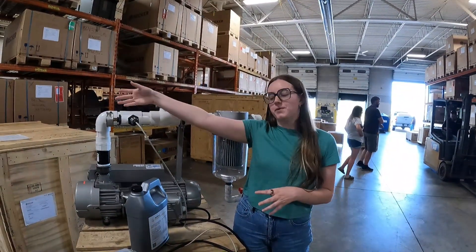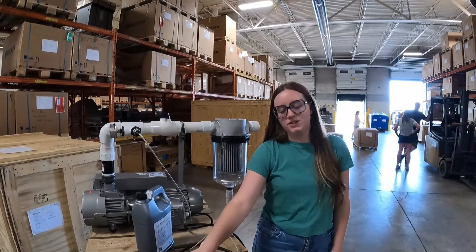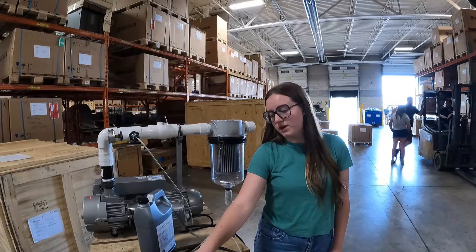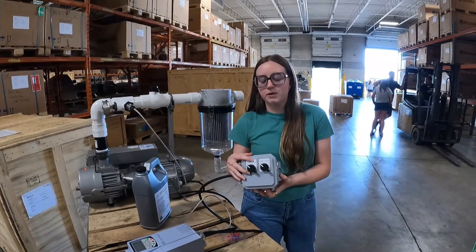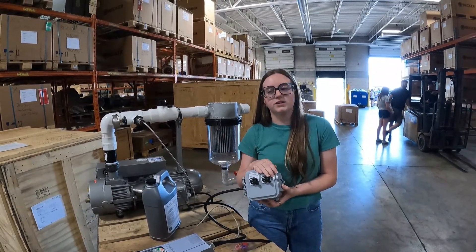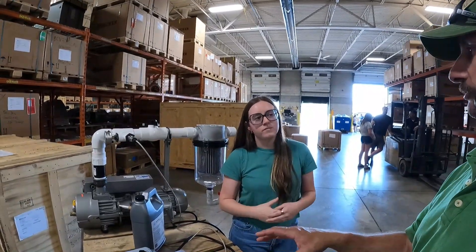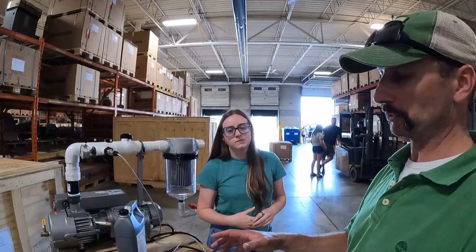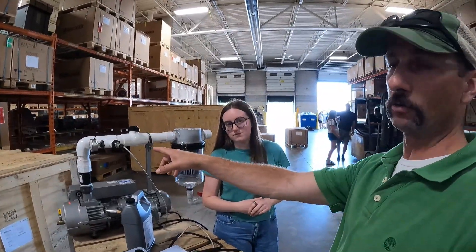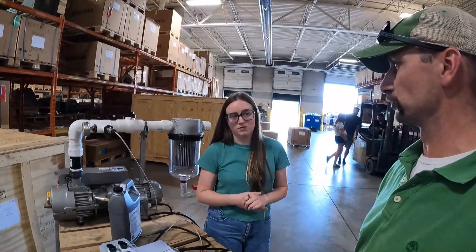You also get a liquid vacuum gauge on the pump as well as a vacuum transducer that measures the vacuum level and relays a signal back to the frequency drive. Every system comes with a frequency drive that's pre-programmed and pre-wired, with the pump motor wired up and a switch box. The switch box has off, on, hand mode, and automatic mode — hand mode sets the frequency manually, automatic adjusts the pump speed based on the vacuum level it's reading. Finding micro leaks is easier because if the hertz are up a little bit on the drive you'll know you've got leaks in the woods, even though the gauge still shows 29 inches.